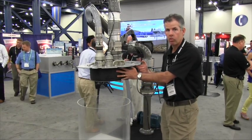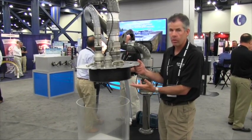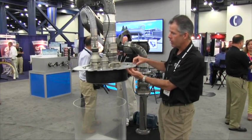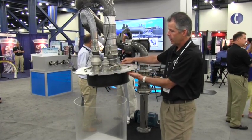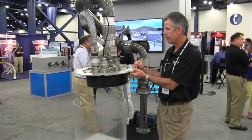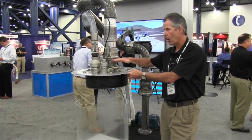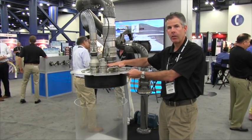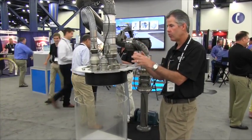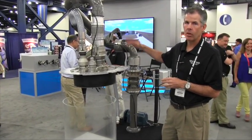With the old unit it was exposed, so as you put it in and out of the truck hatch or rail car hatch, it could damage the seal. With this design it's protected. Our lockdown ring is integrated into the cover plate, so it spins to give you easy alignment with a hatch bolt. We also have a flat top, so water or ice is not going to collect on it. With the old design it was more of a bucket shape, so you could collect water and ice, which could create issues with balancing the arm.